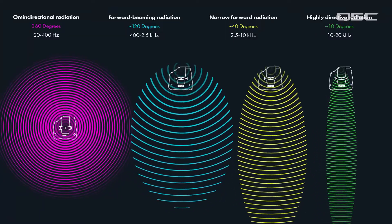When a loudspeaker is up against a solid surface, the low frequencies are reflecting off of that solid surface and then summing back with themselves moving forward, creating a significant level increase in the front.